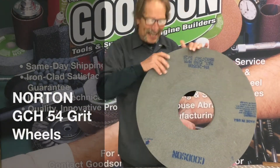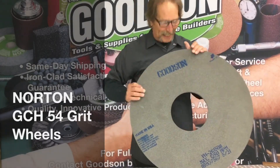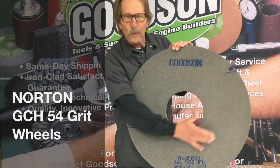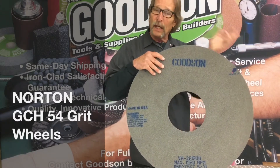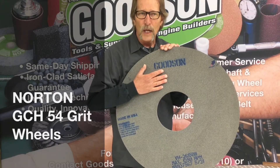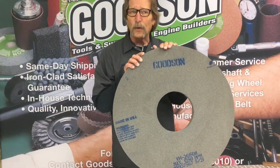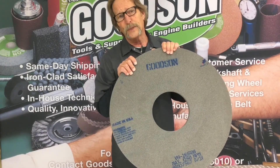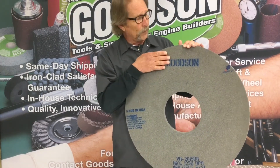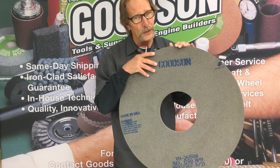We should have some big strong guy moving these grinding wheels around — that's for sure — versus a fast-talking slicky boy like Dave Monahan. But this is the Norton abrasive. This is our GCH, a grayish looking grinding wheel. It's also a 54 grit like that Radiac. This is designed for materials that are less than 35 Rockwell. It's for nodular iron, for steel. We can hit the big radii with this, and we also have a lot of performance grinders on this particular wheel. You can use it on standard Chevys and Fords because it does grind a little bit cooler, holds a good radius, and is good for forged steel and nodular iron applications.